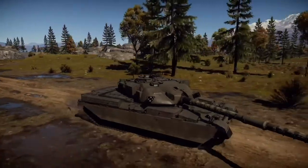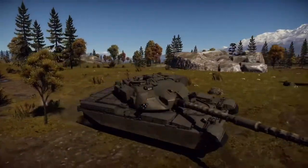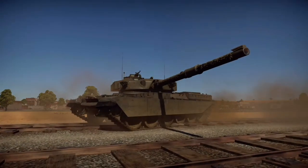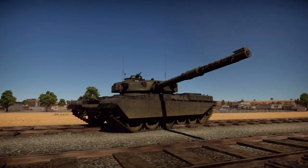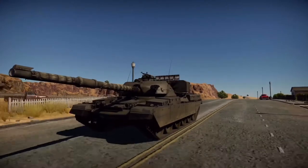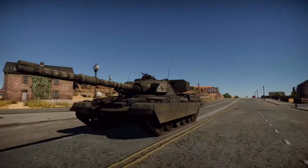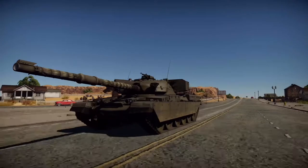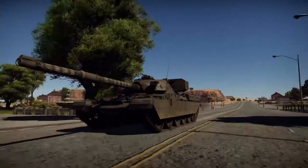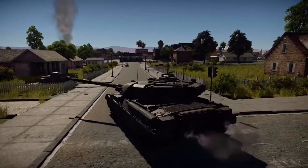This is just the British way of making things unnecessarily confusing. The Chieftain was upgraded a lot because of its absolutely terrible engine. The L60 was plagued with reliability issues — it's estimated that throughout its service life only one third of the total fleet was operational at any one time, with the rest undergoing maintenance. The multi-fuel concept was good in theory but not viable in practice, as the engine primarily used diesel anyway, and converting to another fuel type required a full engineer team eight hours. The L60 also had a tendency to leak oil and produced an excessive amount of smoke, which isn't ideal for a combat scenario.